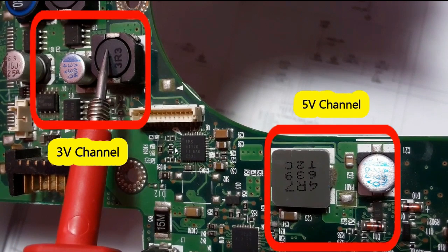If you have all inputs present but outputs are missing, the IC is bad. But if an input is missing, the IC is not necessarily bad — you should look for that input first. For example, here we have the input voltage of 19V, the enable signal, clock signal, shutdown signal, and the power good signal. If power good should be 3.3V but you find 0V, that doesn't mean the IC is bad — you should first restore the 3.3V power good, then judge whether the IC is good or not.